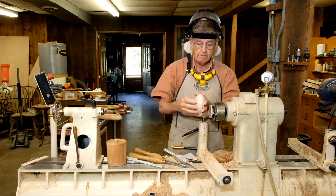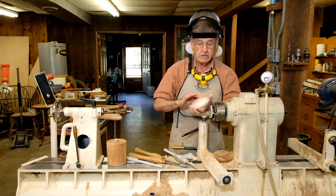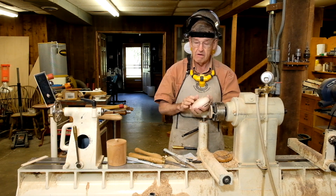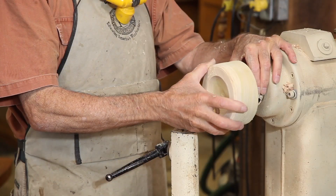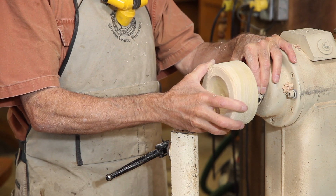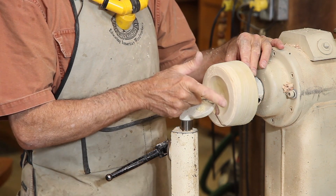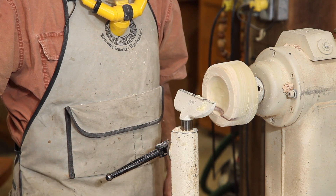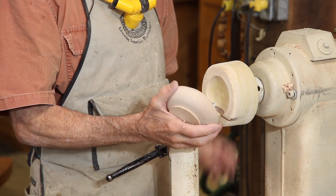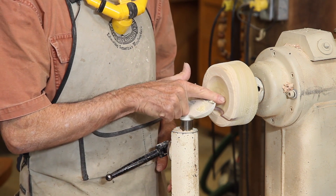I'm going to show you how to put this in another chuck and make this perfect. However, if you want to skip that step, you can with intelligent use of a random orbital sander — just sand this out and it'll come out beautifully. It's your choice. But being a turner, I like to turn it if I can. I've taken what until a few minutes ago was a piece of firewood, bandsawed a piece out of it, mounted it on a faceplate, turned it round, and faced it level. It is faceplate turning — the grain is running this way. The next task is to turn a tapered recess in here. I've already hollowed it out a bit with a bowl gouge.